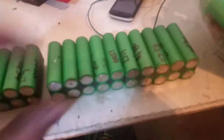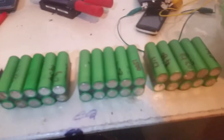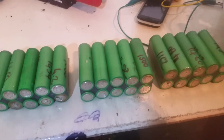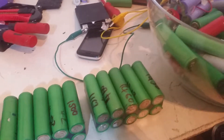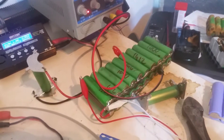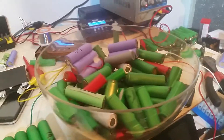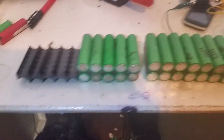Anything between 1200 and 1500 milliamp hours is definitely going to get used in packs like these, to make a fairly substantial 3.7 volt battery pack. All I do is capacity-match the first one to the second one — the second one might have more or fewer cells depending on the quality. I'll discharge the one that's already set up, and build these other ones to get them complete, and see what capacity we've got. I could keep that one as it is, build this one and that one, and I'll have a 12.6 volt battery.